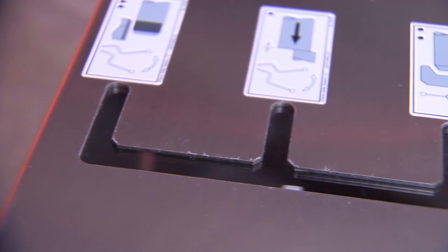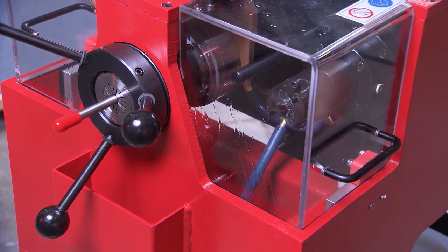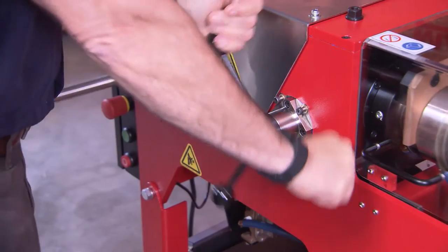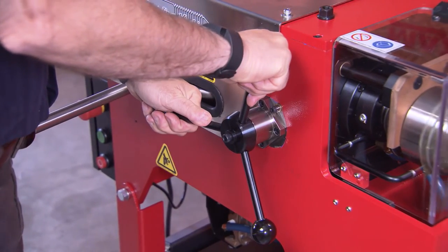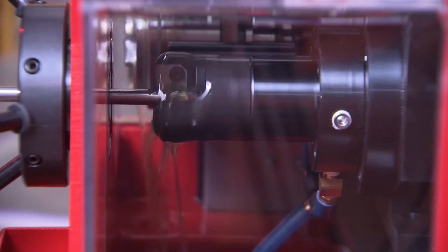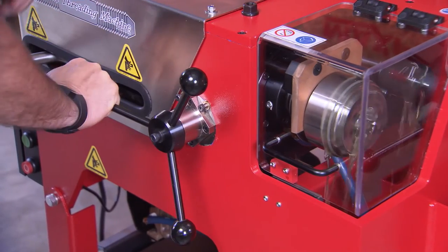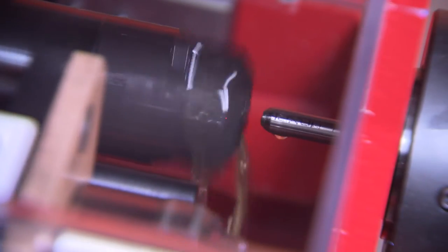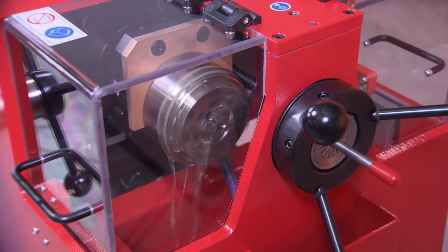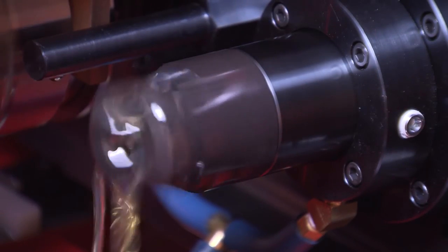Pull the lever handle to move the indicator to the coning position. The oil splatter shields must be down in order for the machine to operate. Now turn the machine on. Rotate the coning feed handle towards the front of the machine, moving the coning tool towards the tubing. You will be able to tell by feel and sound that the coning process is underway. Once a full stop is reached, reverse the coning feed handle to retract the coning head from the tube. Oil is supplied through the center of each spindle shaft, which puts the oil at the exact location where the cutting occurs.